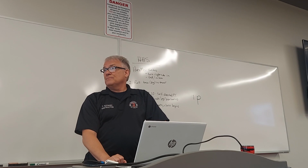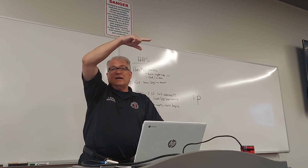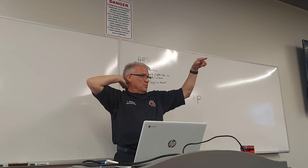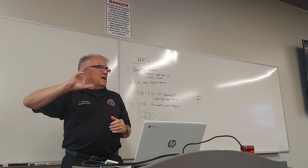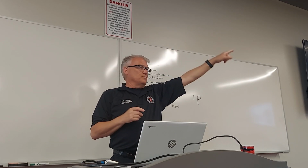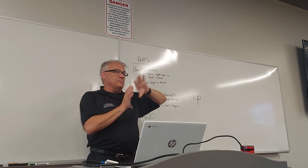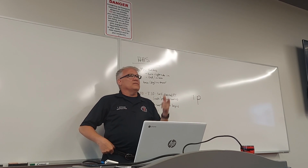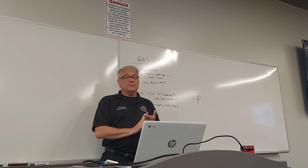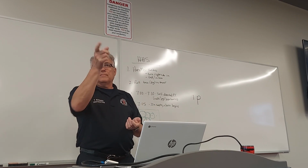It's called the tamper switch. If anyone messes with the valve, then it sends a supervisory signal that there's a problem. Okay, so if you've ever been in an enclosed stairwell and you turn that valve, it's going to send a supervisory signal that someone's tampered with it. So that's not going to necessarily evacuate the building and sound an alarm. It's going to notify maintenance that something needs to be serviced. Okay, we don't want to evacuate the building because somebody twisted a valve.